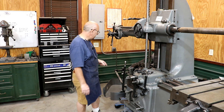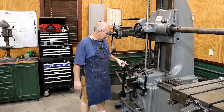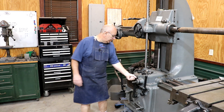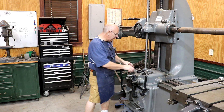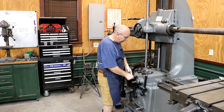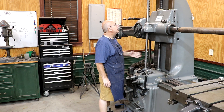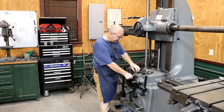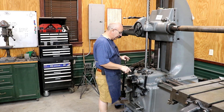First off, let me just kind of fire this machine up. Make sure my phase converter is on, and I'll show you what I mean here. I'm going to engage the power on it. You can see it moved just a little bit and it won't go any farther. If I go in the other direction — this is going up — the head does move up okay, but it gets in a little bit of a bind coming down, and it's just enough that that washer is slipping. So that's kind of what I'm trying to fix here.